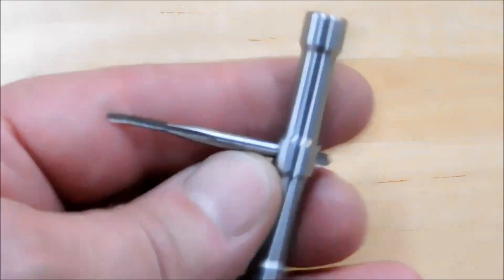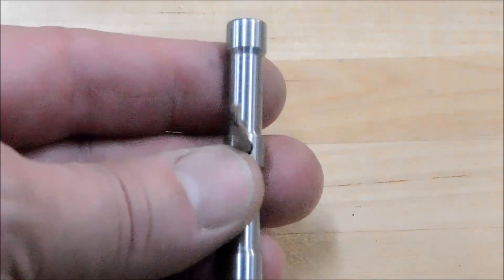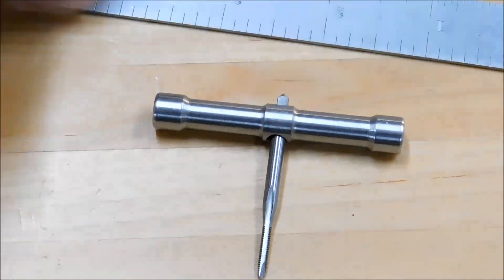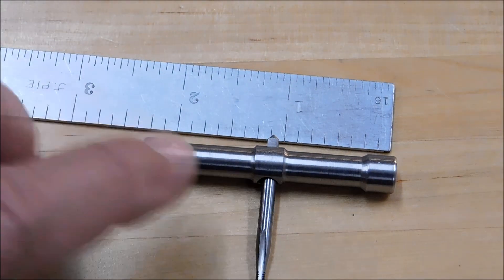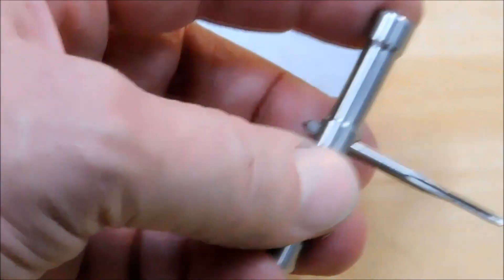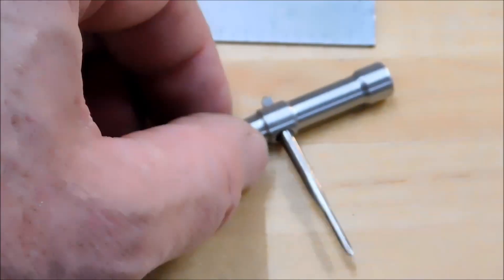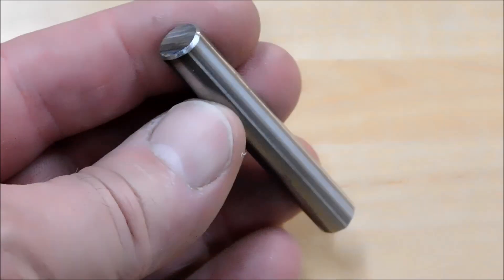I've been getting my fair share of comments on this little guy right here. This little handle gives you great feedback on smaller taps. This is at 256 so you can see just about how big it is size-wise — it's about two and a quarter inches long, 375 diameter stock, which is about just under 10 millimeters, maybe nine and a half millimeter diameter. Let's knock one out real quick and show you how easy it is to make one. I'm making mine out of 17-4 stainless — you can make yours out of whatever you want. Let's do it.